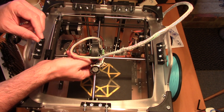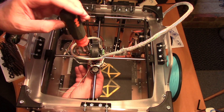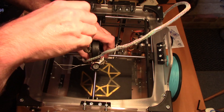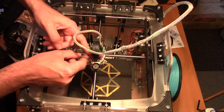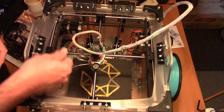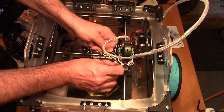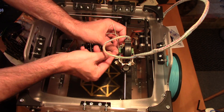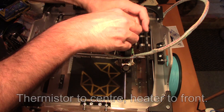With this kit everything comes as components. Here I'm fitting the hotend into the print head at the top — you have to remove a couple of the screws already in there because the fan mount screws into the same parts. There are some little black insulating spacer washers for electrical reasons. The hotend screws into place with a little hose connector fitting that the PTFE tube pushes into, then you tidy up the wires and screw those into the terminals. The fan wires go into the middle two terminals and the heater cartridge goes into the front two terminals.